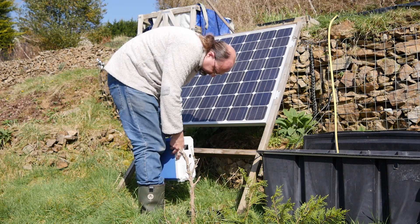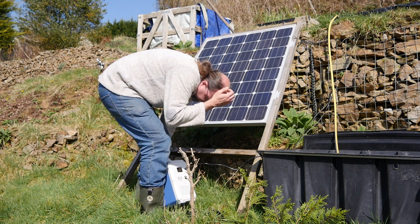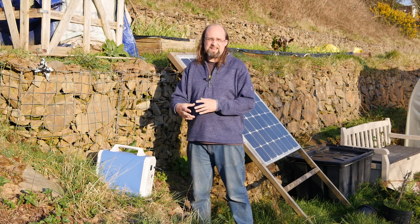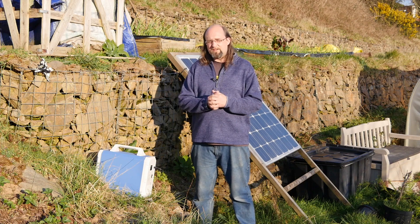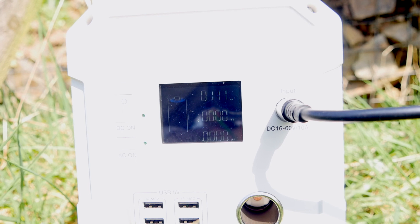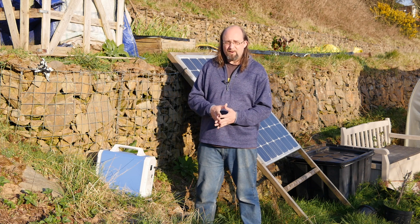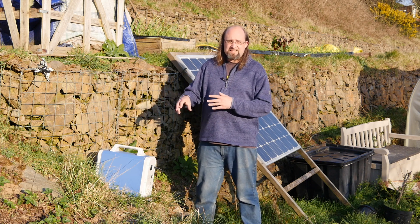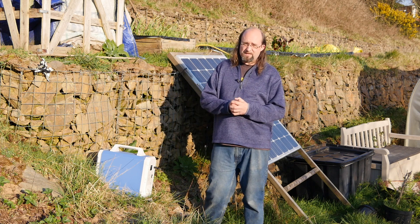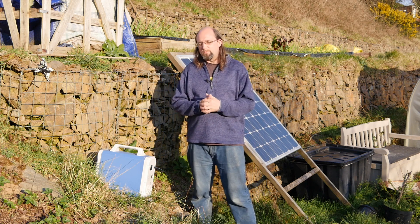This is just one I picked up a couple of years ago for about $100 to $200. I think it's rated to 180 watts. In the peak of sunlight today I was getting around 120 watts into here — it's still springtime in the UK so it's not as full as it could be. This morning when I plugged it in it was getting 60 watts. Right now it's saying it's about 50% charge, though it's hard to tell exactly because there's just five different segments on the display rather than an exact number. That's after being plugged in for a good five or six hours today charging off this small solar panel.